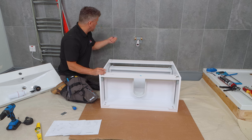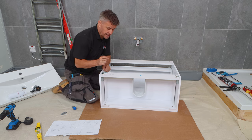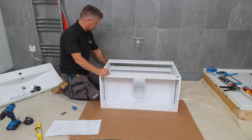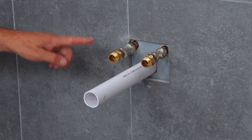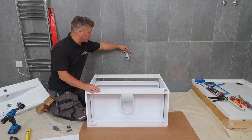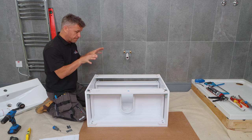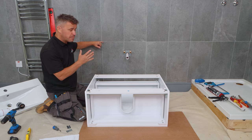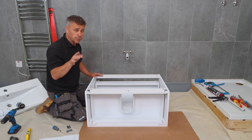The back of my bracket has little teeth coming out and the wall plate will slide underneath there, then be tightened back up again when mounted to the wall. We need to work out our location. The fitting manual says a minimum of 753 millimetres off the finished floor height. However, you might be dictated to by your existing pipes — you can put a flexi hose on your hot and cold, but your drainage is going out at a certain height. My unit has about five to ten millimetres of give from the measurements in the brochure. So do double check.